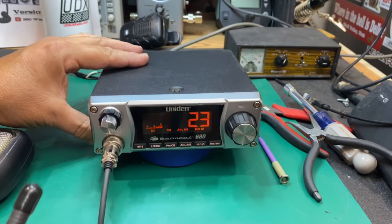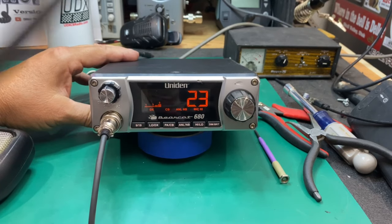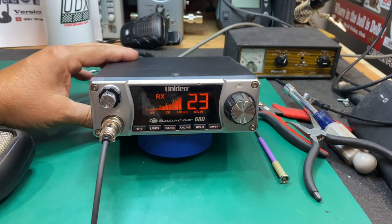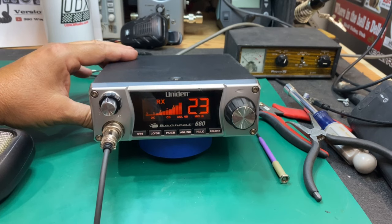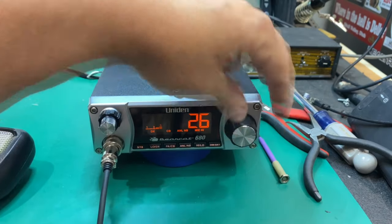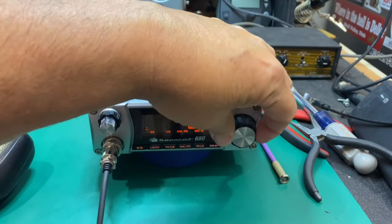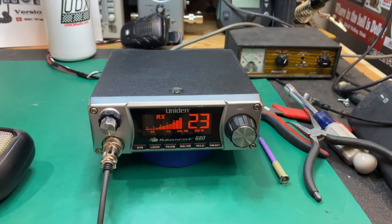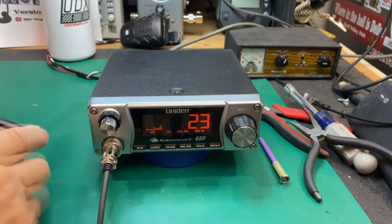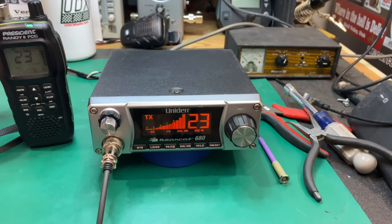I don't have one of those professional technician CB radio repair pucks, so blue tape to the rescue. It's got a pretty decent receiver in it. Let's check adjacent channel rejection just for giggles — I get a little bit of bleed over, but that's alright. We got the walkie going. I'm using the Digimike — that is cool. Always that delay with the digi mics.